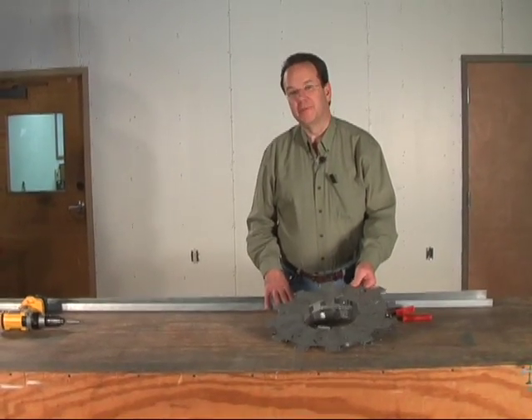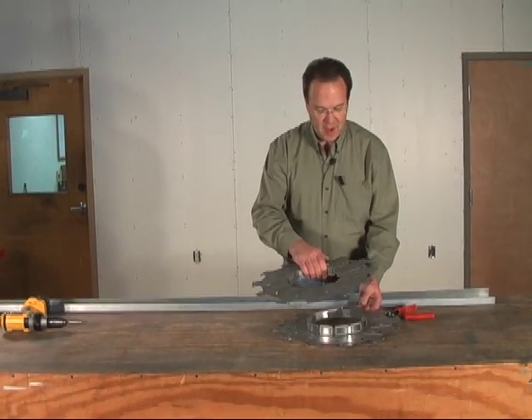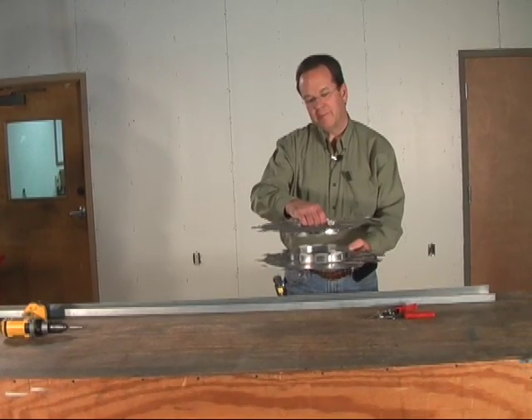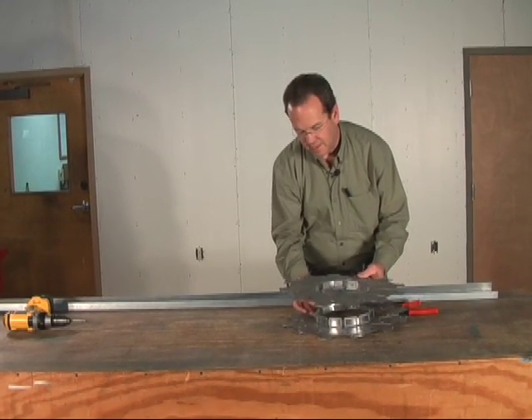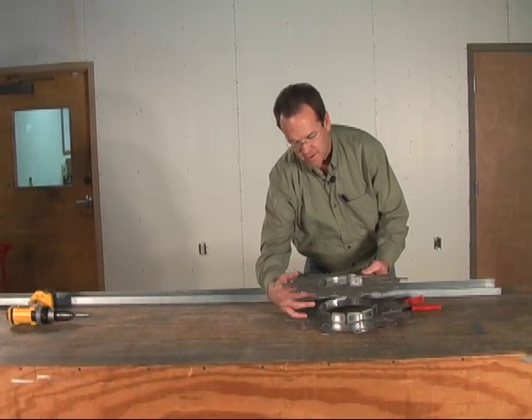Now I'm going to be working up here on the bench for a while. Just like in those cooking shows on TV, almost magically we have two completed pieces. This will make the top and bottom of our compression ring, but we need to join them together with a three and five-eighths band of metal — three and five-eighths because that's the size of the ribs that are going to be coming into the pocket it forms.